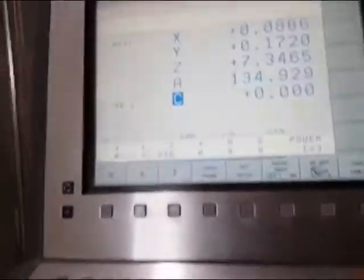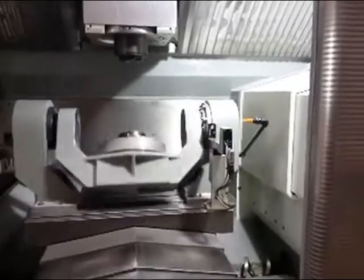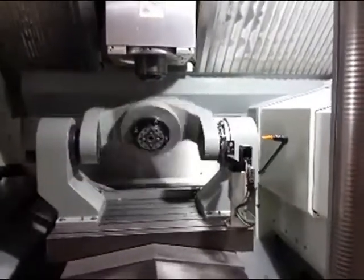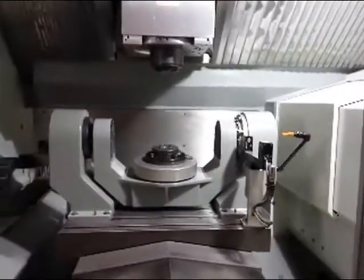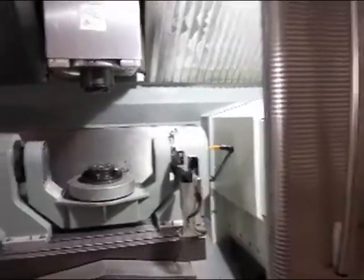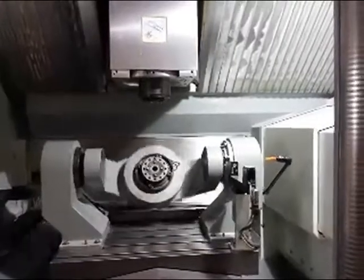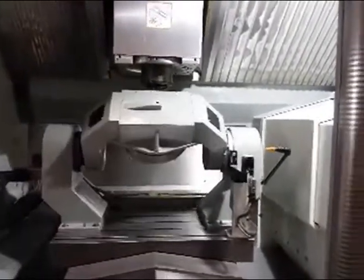DMC 64V 5X linear machine here — it's a running table. You can see the speed of that table, very very fast. It goes 135 plus, 135 minus, 360 full 360. You can see how the speed is. Renishaw laser, Renishaw touch probe — it's just phenomenal how fast that machine is. It's a linear drive in X, 30 tools, 12,000 RPM, cool-and-true chiller, everything.